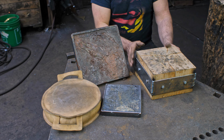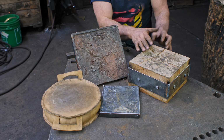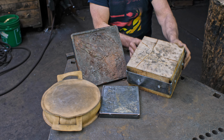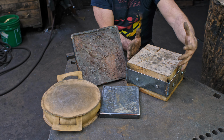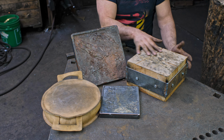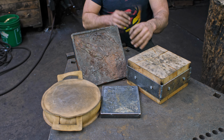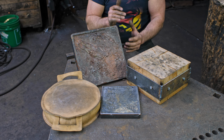Another surface that I used was this piece here, which is a piece of softwood stump. Well, it's a beam. It was an end cut off a soft beam. I think this is actually fir, I believe it is. Anyway, I did a steel banding around it, and the thing was splitting and opening up, and basically compressed it. So the whole thing is compressed and held in place, but what you've got is soft end grain here, which gives a resistance which is a little bit less than the lead, but not as crumbly as the pitch. So I just find it's great to have a number of options, and depending where you are in the process, you can move from one to the other.